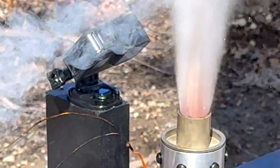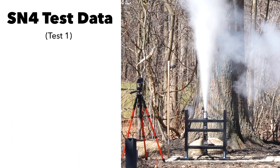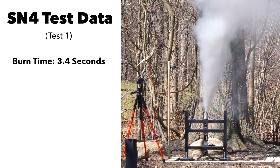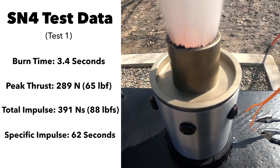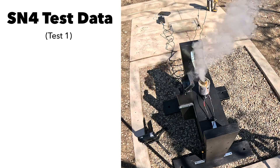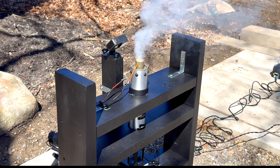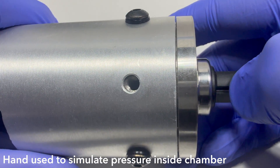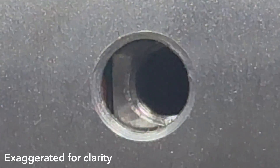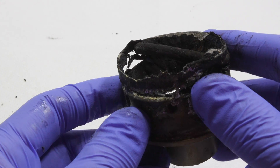From the test footage, the nozzle did not last long — early into the burn it blew out the side and sprayed molten aluminum at my GoPro. Thankfully I was able to fix my camera. SN4's first and only test gave a runtime of 3.4 seconds, a peak thrust of 289 newtons, a total impulse of 391 newton-seconds, a specific impulse of 62 seconds, and a max pressure from the pressure transducer of 312 psi. Also, if you watch closely, you can see gas leaking around the bulkhead under pressure — the bulkhead shifted slightly, causing the radial bolts to move to the outside of the holes on the casing, slightly exposing the o-rings and allowing gas to escape, which could have led to a full RUD if it had gotten worse. Still, SN4 was an exciting test and worth exploring as an alternative nozzle material.